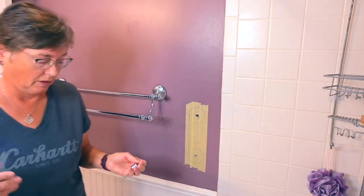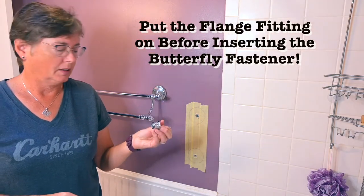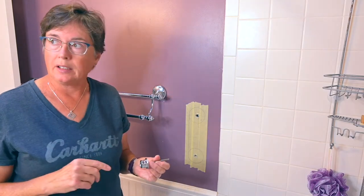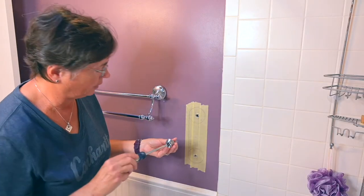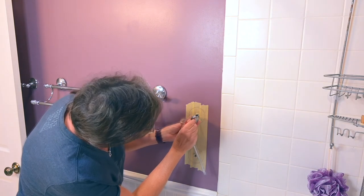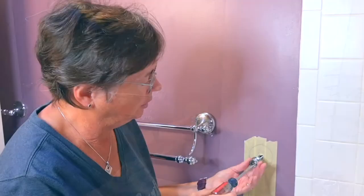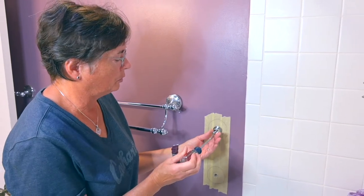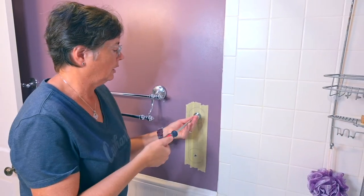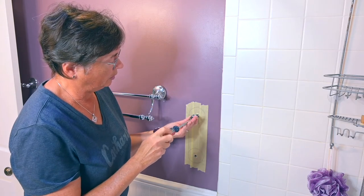I have a problem — I made an amateur mistake, which can happen to anybody. That is, I forgot to put the attachment on, which is the fitting that holds it tight to the wall. The bad news is I may have lost one of my mollies. The good news is it's still lined up back there and I might luck out. Cross your fingers and let's see if I can get it back into the nut. Got to be very gentle. I got it — I lucked out on that. So it's good to put just a little pressure on the back of the screw to pull it forward, and this helps get the screw in place.